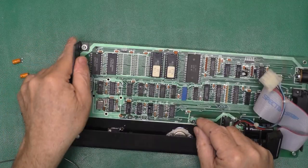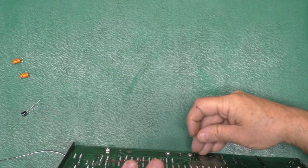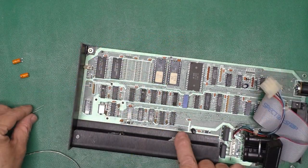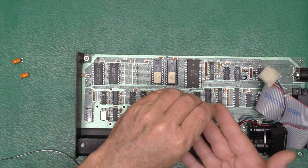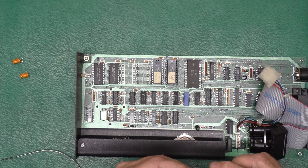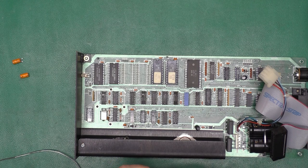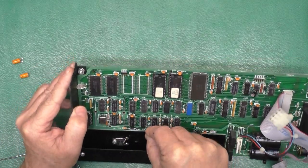And there are standard sizes of lead pitches that the insertion machines know how to deal with. The caps come in a paper tape, kind of those ammo belt type things you've seen, and it has fingers that pick up each lead like this. So it'd be like that and holds on. And if the parts are not at the correct pitch, it'll spit them right out. It can't get a hold of them. And if it's a really common part, like a 0.1 microfarad, it will really ruin your day. Ask me how I know that.